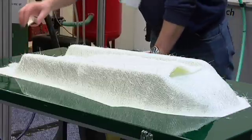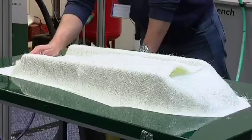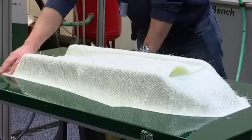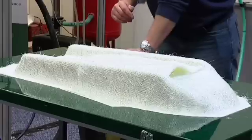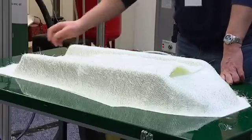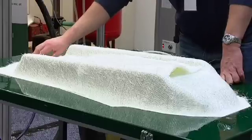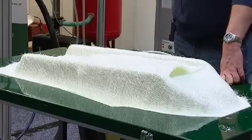What we've done this morning, to avoid you inhaling fumes and seeing the messy bit, is apply a gel coat to it. So there's a gel coat surface on there which can be used in the process for aesthetics, and doesn't have to be used. And we're using a combination fabric — again fairly low volume fraction — and combination fabrics are designed to give us a defined thickness of component.